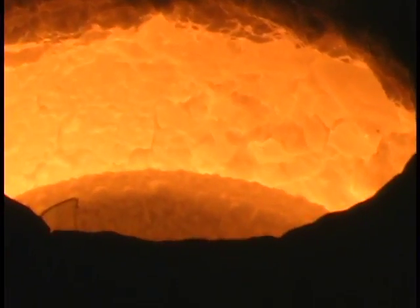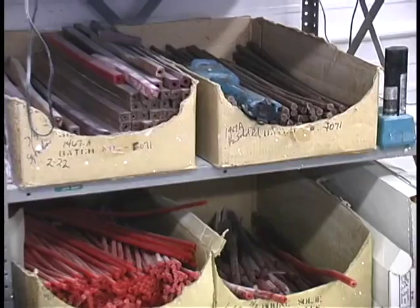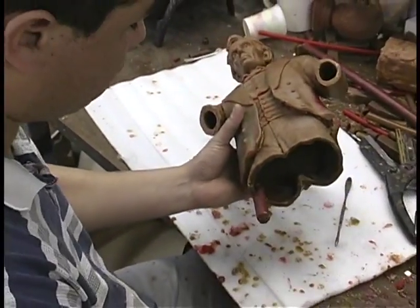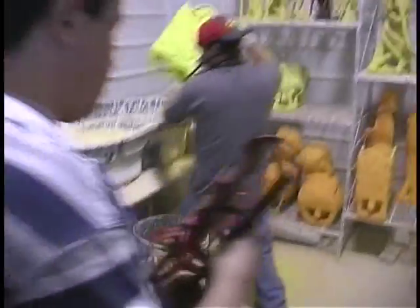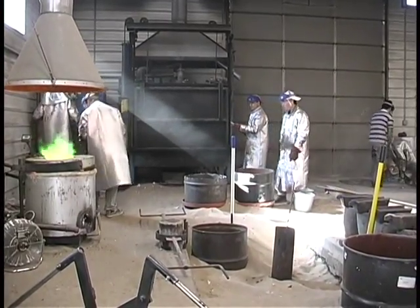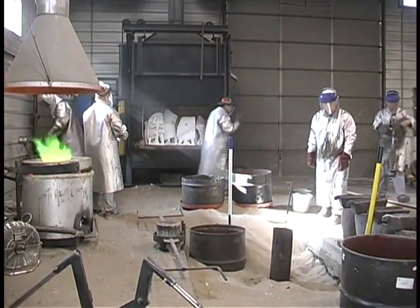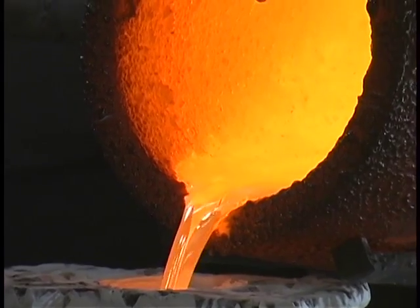To begin, the art of bronze casting is centuries old and the most formidable technique was by using lost wax. Lost wax is where you make a product out of wax first, then put on the gates — sprues that allow the metal to go in — and vents which allow air or gases to escape. You would put it into an investment mold, which would then be put into a kiln to be burnt out. After the kiln had purged all the wax from the mold, the bronze would be simultaneously melted, then poured into the lost wax investment while the mold was still warm.